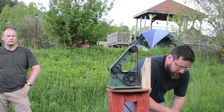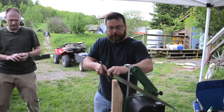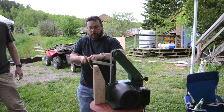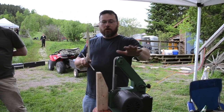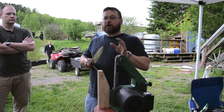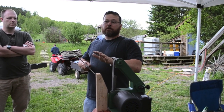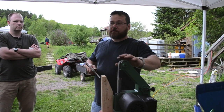Now go to 800. The finer you get — the more you go up in grit — the longer you spend on each belt, because it's cutting less and benefiting more from increased polishing. The 800 grit is like a mirror finish belt. 2,000 grit is a super mirror finish. I think Albion's finish is around 240 grit with Scotch-Brite on top. With 240 you can get a decent, nice-looking finish. So at this point, 800 is already a polishing belt.